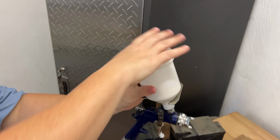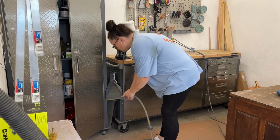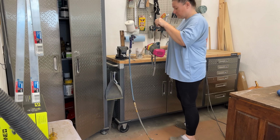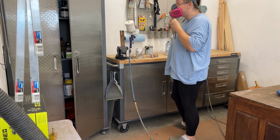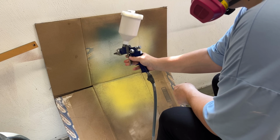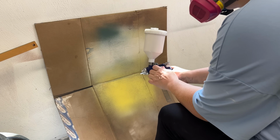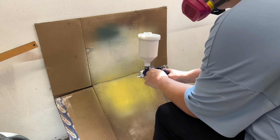This is a urethane enamel. It has a 4-hour recoat time and then takes a few weeks to cure up to its full hardness and durability, which is typical of most paints. But this stuff is tough, and I've really been liking using it on my furniture because I can totally trust that it doesn't need any additional top coat.